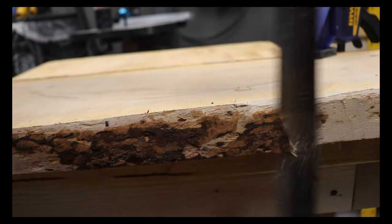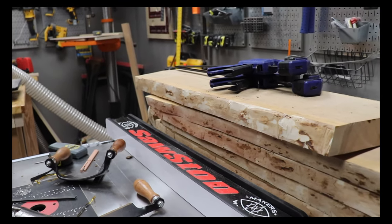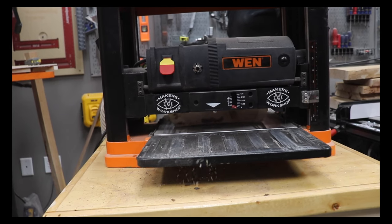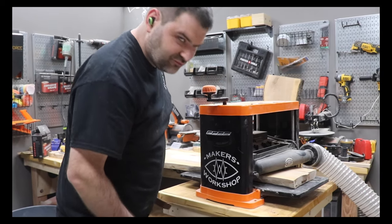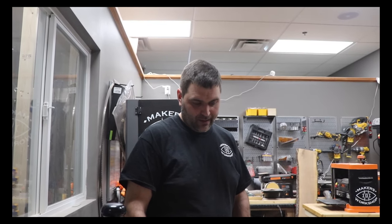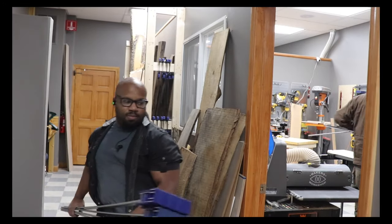With the slabs trimmed down, it was time to pull the bark off using a nice sharp draw knife. Then, it was time to plane down each piece into a nice flat workable board. We had almost a dozen boards to do, and within 2 passes on the first slab, our one planer completely jammed. So we moved over to the drum sander. But it just wasn't the same. So I went for a Home Depot run to buy a new, heftier planer.